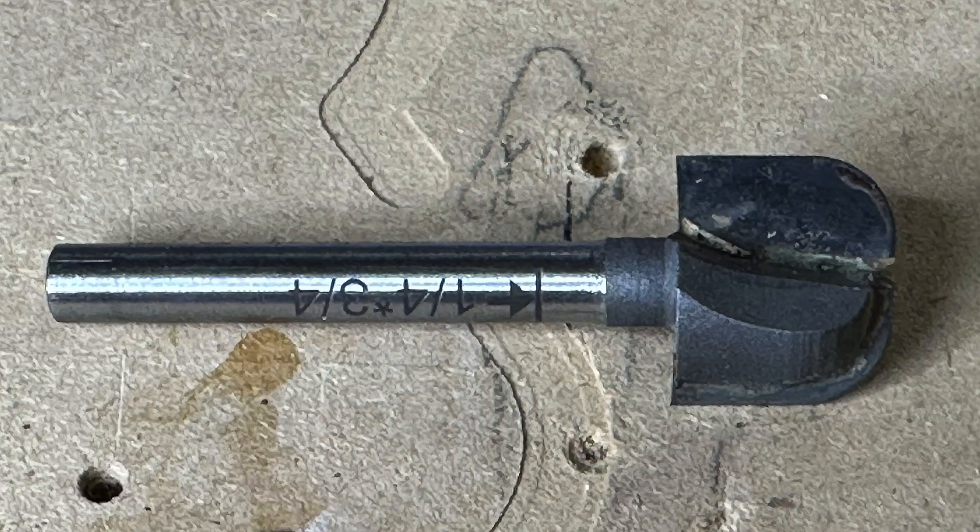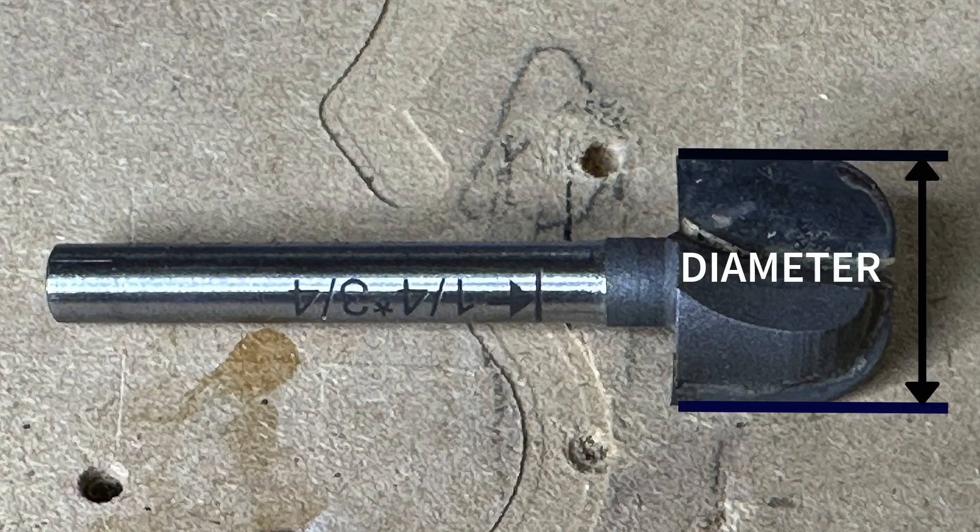Making a dish and carving it is pretty straightforward. If you know the bits that you want to use, that will make the job much easier. Let's take a look at a typical bowl bit. The parts we're most concerned about start with the bottom of the bit, which is the diameter — basically how much of a cutting path it can take.